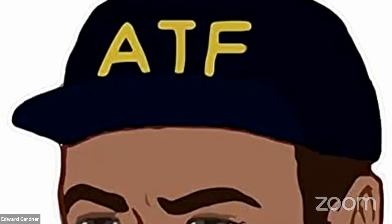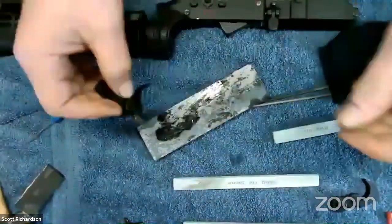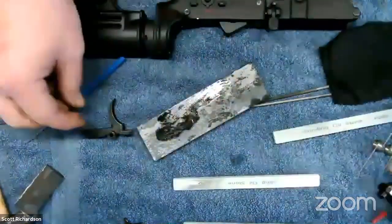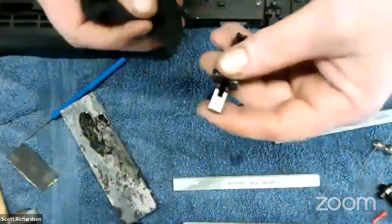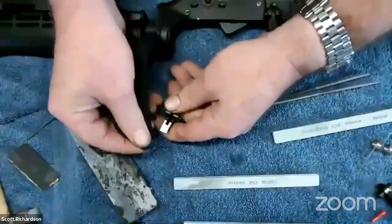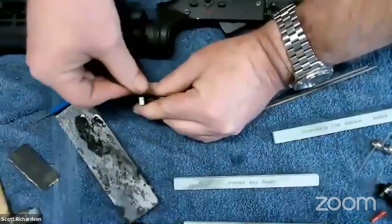It's getting smoother and smoother — this is very tedious but that's the nature of the beast. At this point it's much smoother than it was. I take it all the way down to where it's glinting, like chrome — that's what I want, super shiny. I also use this stuff a lot: Flitz metal polish. It's about the consistency of slightly runny toothpaste. You put it on the surface you want to polish and go at it with a rag, a wire, or a cotton wheel.